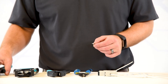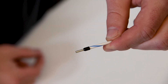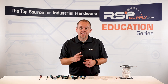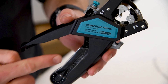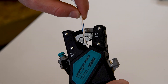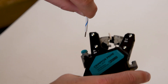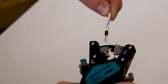Let me demonstrate how we do this. We take our stranded wire and slide the ferrule on, making sure not to fray the wire in any way. Once the ferrule is fully seated, we take the crimper, push it all the way on, and simply crimp the ferrule onto our wire connection. Where the ferrule crimper only does one step, there is another tool that does all four steps, saving you a ton of time — this is a four-in-one ferrule crimper. It has the ability to cut the wire, strip the wire at the perfect amount, twist the wire removing the insulation, and lastly crimp the ferrule onto the stranded wire, giving us the perfect ferrule connection every single time.